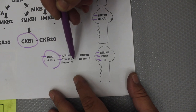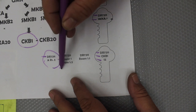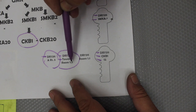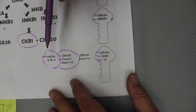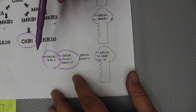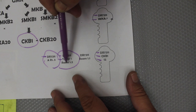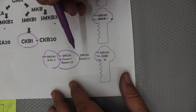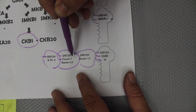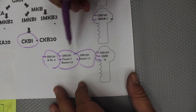Leaving yourself logical notes gives you a path to track back — a lot of electricians do it that way too, and on a complex system it gives you half a chance. Here's another example written with three lines. Or we could write it as: system number, tower one — if the staff call it tower one, that's acceptable — then room one point two, meaning this is the second key issued for that door. If a key goes missing you know exactly which one.